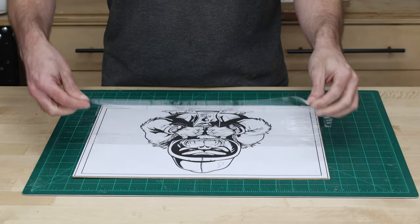Some of these inside corners are really tight, so I'm going to drop down to like a number two blade to get in there. The good thing about a crown tooth blade is it's a really clean cut, so I don't have to worry about finishing. The downside is it doesn't remove a lot of sawdust and I'm still cutting thick pieces, so that's going to make it difficult. One thing that helps with delicate pieces is a piece of MDF — a trick I learned a long time ago. Just a thin piece of MDF that I use as a zero-clearance insert. I saw it in half and put it on my saw top, giving me a stable surface so delicate pieces don't fall into the void between the blade and saw top.